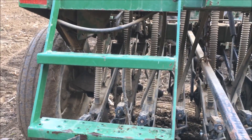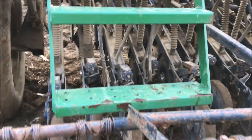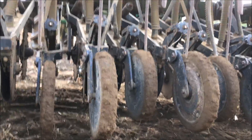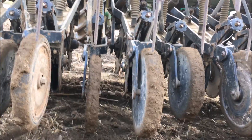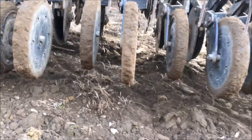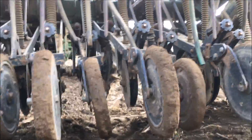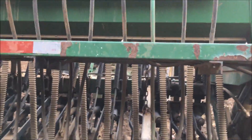There were also some feed guide tubes in there that are metal. The guide tubes were bent on a couple of them, so the seed wasn't falling through — if it got some dirt up in there it was plugging up. So periodically I stop and come back to check these openers. These are the closing wheels in the back, and right in front of them you've got double opener wheels that make a V shape and the seed falls down in between them. I check and make sure they're not full of mud — they all look pretty good. If it's real muddy those things can get packed with dirt and you'll have issues; your seed will plug up and start coming out the top. So I stop every now and then to make sure they're not plugged, and the seed is falling out of all of them.